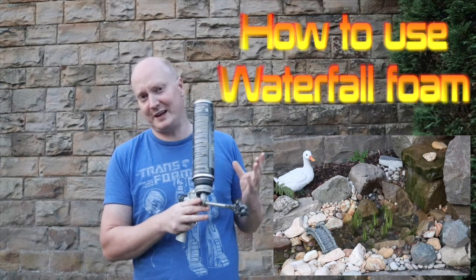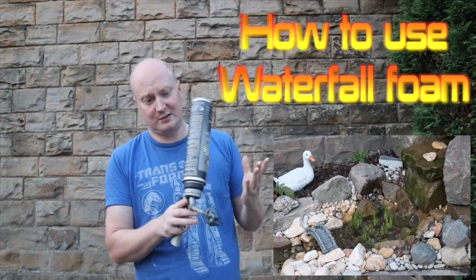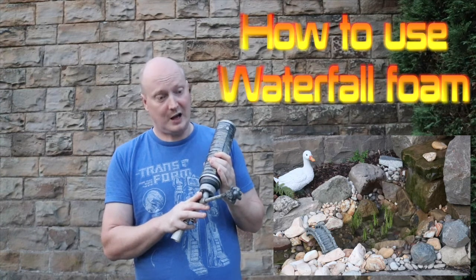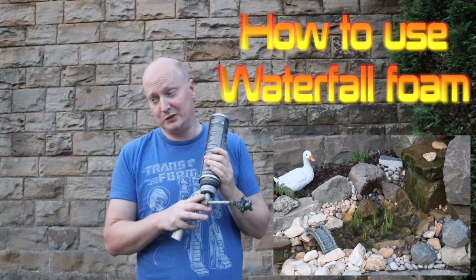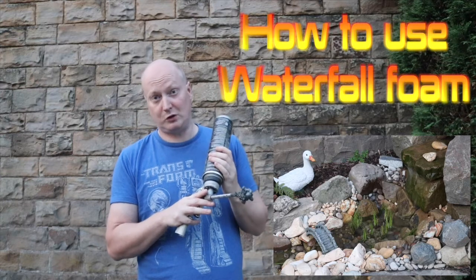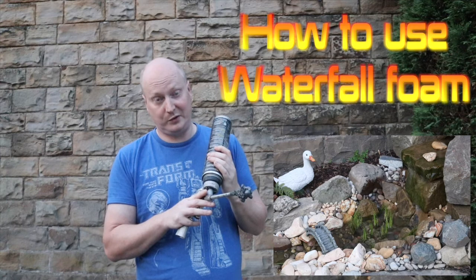It's about £20 a can. The guns themselves are about the same, about £20, so it's quite a bit of an investment when you do get this stuff, but it's really handy for filling in gaps. It also is handy for rocking in, so if you want to not use cement or concrete or mortar, this is a good alternative. It's not quite as strong, it's quicker to lay down, and it's really handy to use.